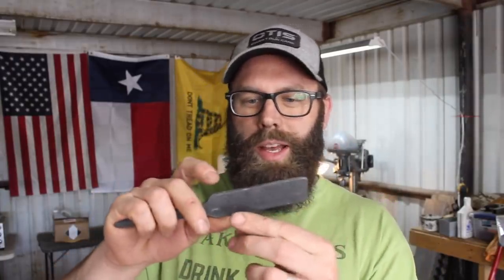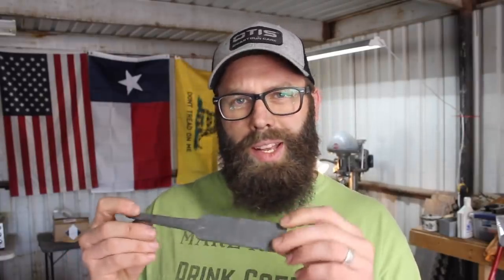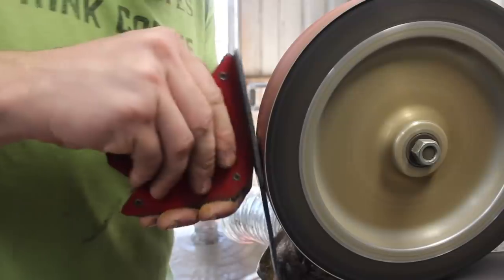But you'll notice that I kind of widened it out as well as forging it lengthwise, and that's so that I wanted to try and maintain some measure of roundness, if you will, to the ball bearings that you're going to see, instead of just making them completely stretched out. So that's the purpose for that, and the blade design I have in mind is going to be great with that. But I still don't know what it looks like, and I'm not really sure exactly how it turned out, so let me grind this scale off, and we'll dip it in some ferric chloride and see what exactly we have here.